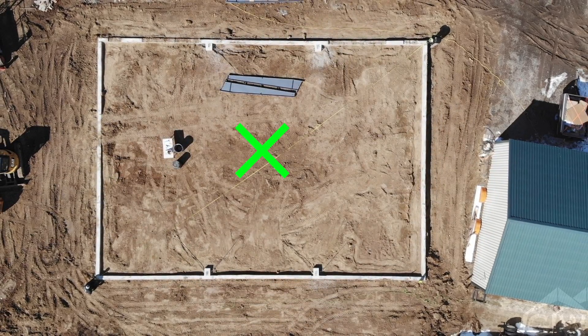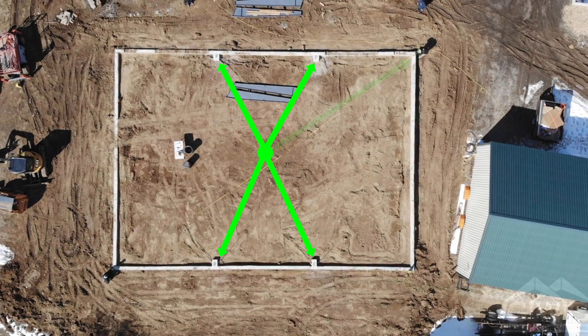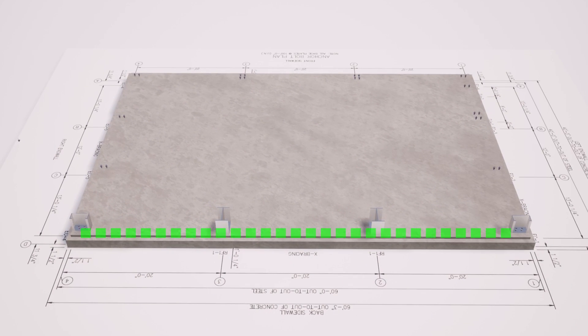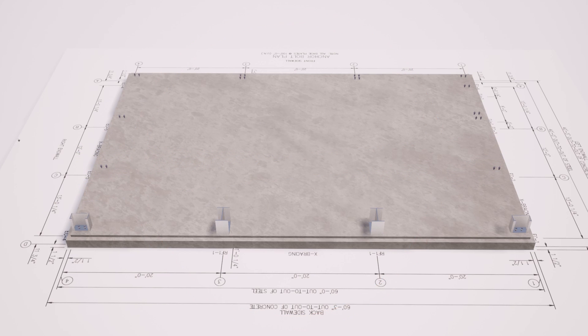Set up in the middle of the building footprint and make sure you have a direct line of sight to where each column is going to attach to the floor. Using the bubble on the transit, verify that it's exactly level and plumb. Spend some time here — over 60 feet a slight deviation in plumbness can wind up being the better part of an inch or more. I guess this is why lasers are all the rage — set it and forget it.